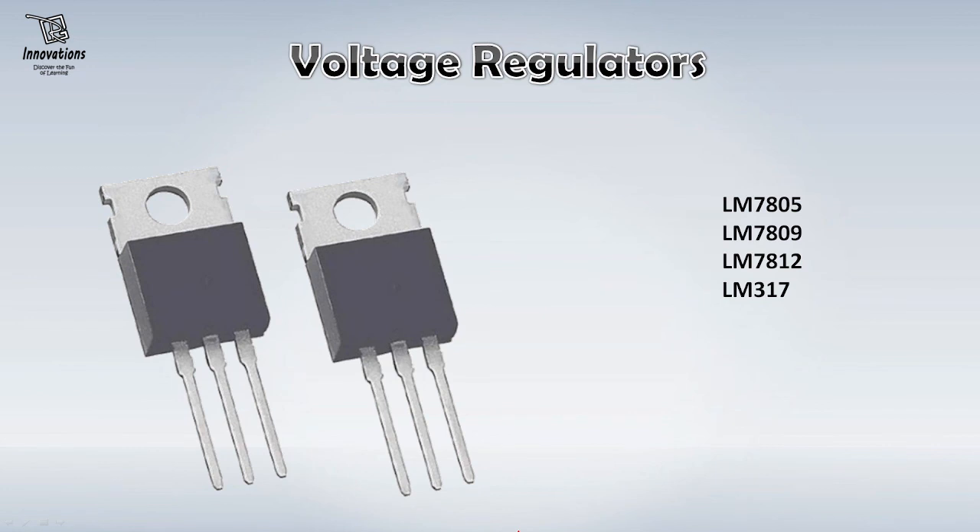The last component you should have in your inventory box are voltage regulators. Voltage regulators are used to limit the power supply to a project. Like if you are having a 9V battery and you need 5V for your project, or if you have a 12V battery and need 5V, you can use a voltage regulator. I would suggest you should have LM7805 that gives 5V, LM7809 that gives 9V, LM7812 that gives 12V in your stock — at least one piece of each. And the next one is LM317, which is a variable voltage regulator. You can build a variable power supply with this regulator. I have a video posted already in my channel.